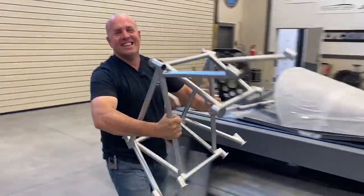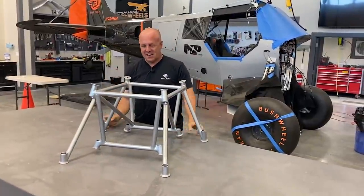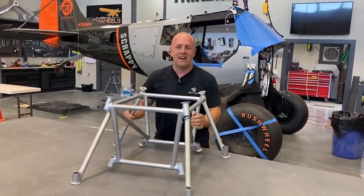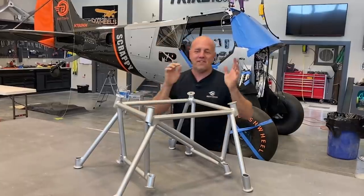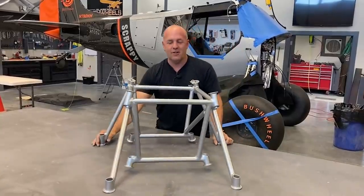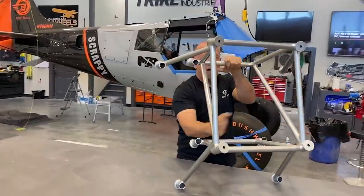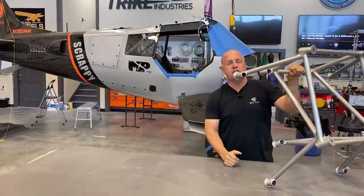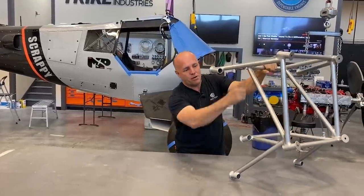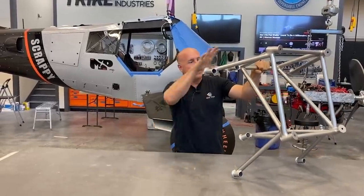Ron with the camera, as always. It's just a motor mount, but I'm so pumped because that means the motor's going on Scrappy. I did a couple of things different with this motor mount. Everywhere I have bars, I wanted every one of them to have some kind of a lean to it — it helps triangulate the motor mount so it doesn't move. Then I have the typical main triangle support that is done on all motor mounts, with a couple extra.